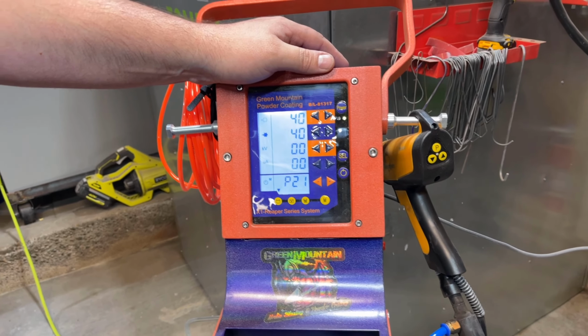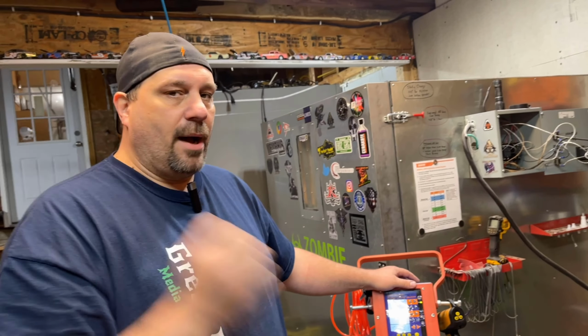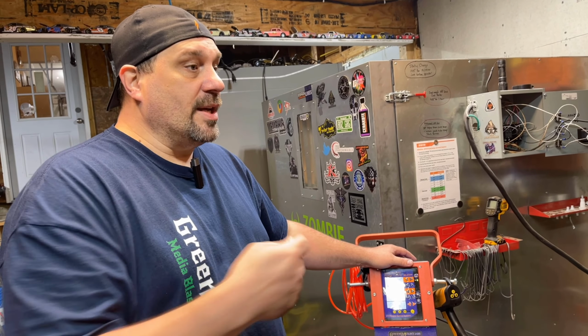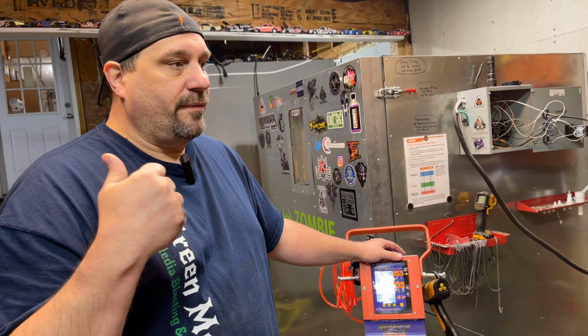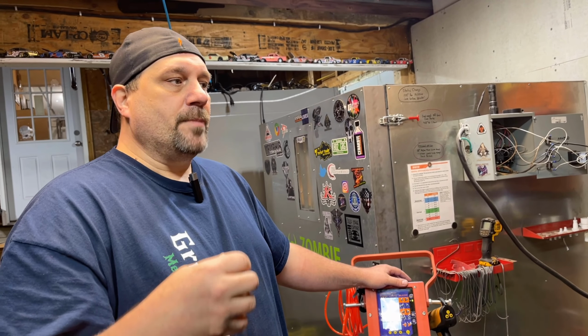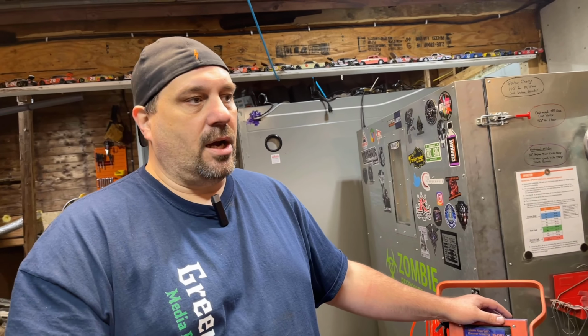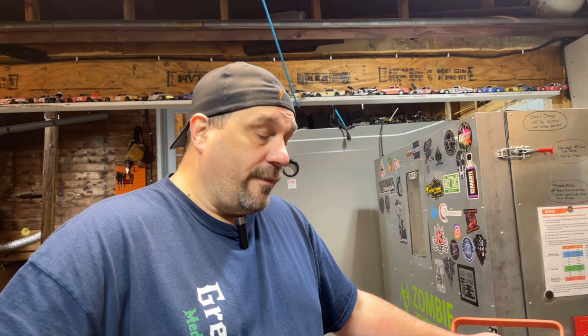So we ended up boosting up the air to try to push the powder in. This time we also brought the powder up to 40. So it's going to be a massive cloud of powder. But I'm feeling that's the only way to force through that Faraday cage and get it to stick inside. It's not like a regular rim where we don't want that huge cloud. Right now we want whatever we can get to blow through these. So we're going to try the 40-40. If it doesn't work, we'll readjust it and hopefully we can figure out the kinks before we get to the circular one.